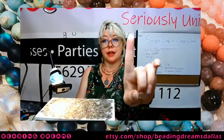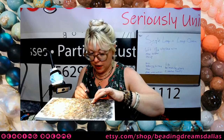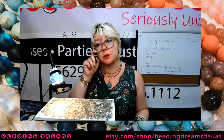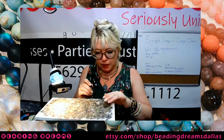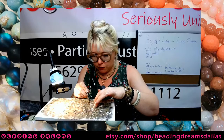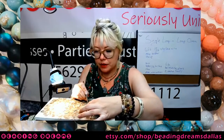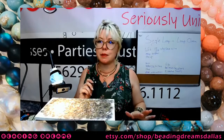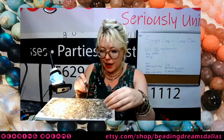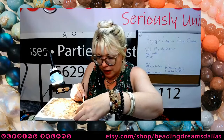So, number one, try your best, and by try your best, I mean absolutely 100% do as I say, not as I do. Keep 6 to 8 inches of clear space between your soldering station and anything around you that is either flammable or meltable. Flammable meaning, of course, that it can get set on fire. Meltable meaning that it can turn from a solid to a liquid state with the application of heat. And here's a fun thing, a lot of plastic things are actually both. Once they've melted, then they can catch on fire. Not the kind of excitement you really want in your soldering space. So as long as you keep 6 to 8 inches of clear space around your workstation at all times, the chances of you accidentally melting or setting something on fire are significantly lessened, because if you're using a butane torch like I am, it's not a very big flame.